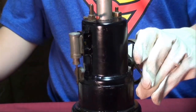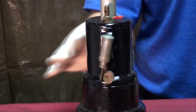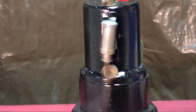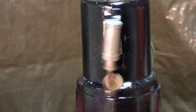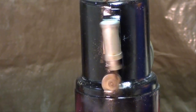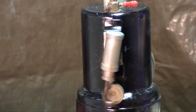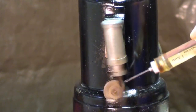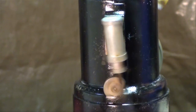Rotate that engine, now we get to watch. I'm going to zoom in to see where it's leaking there. The steam leak, that's where the piston rod goes into the engine. I don't believe there's any kind of real packing, it's just supposed to be a good fit. These little engines were probably very, very cheaply made. Put a little oil in there. Most of that gets washed away.